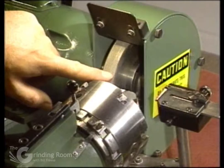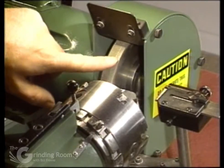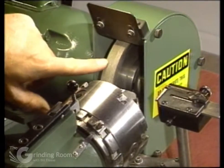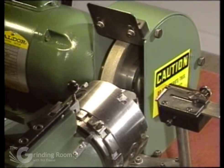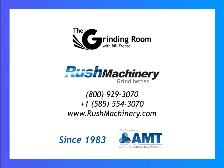The wheel used here is a plated CBN wheel, which is very good for point splitting. You can also use it for regular point grinding. You want to use a wheel that's about 6 inches in diameter, which works for almost all applications.